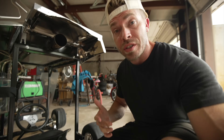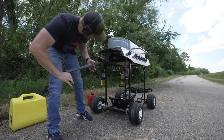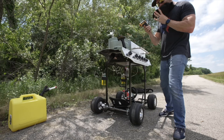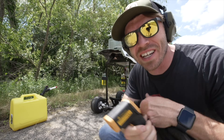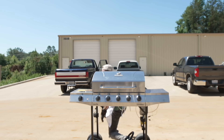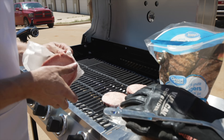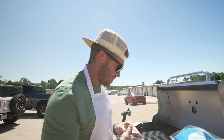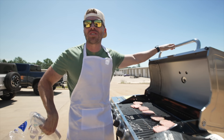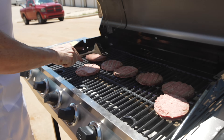What I think is happening is the air is moving too fast — all the heat is just blasting out the back. So I have welded up this baffle of sorts. It slides down, sits about halfway down in the tube, and I'm hoping this slows the air down just enough to let the heat radiate into the body of the grill. 414 degrees — 212 Celsius. How do you like your burgers? Well done? Excellent. I really wish these weren't frozen; it might take an embarrassing amount of time. Dude, it's got grill sear marks! Look at that. This is amazing. It's slow — shockingly slow — but it's working.